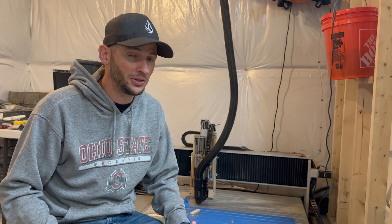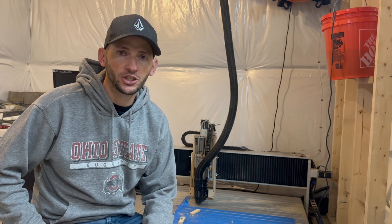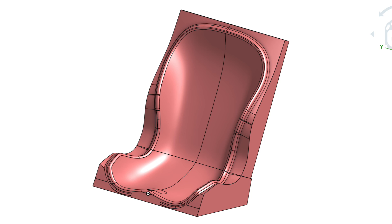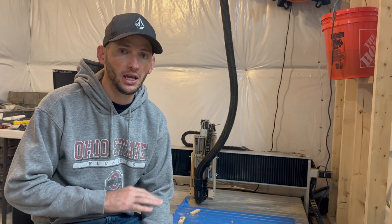The only thing I'm trying to do is make a really cool looking carbon fiber seat, so quality is pretty important. The plug is usually made from a material that's pretty easy to work with. In our case, we're going to be using Pink Panther foam, and we'll finish off the surface with some fiberglass cloth, followed by some Bondo and some high-build primer just to make it really smooth. Once you have the plug finished, you can make a perfect replica by laying up your mold directly on the surface, using a layer of gel coat to protect the surface, then a few layers of fiberglass for strength.